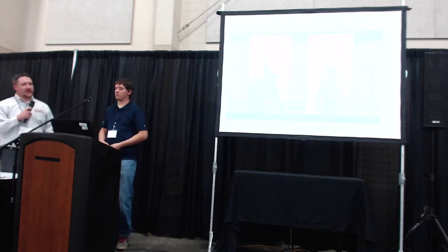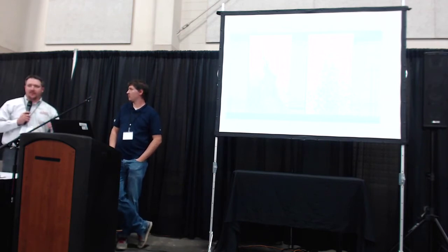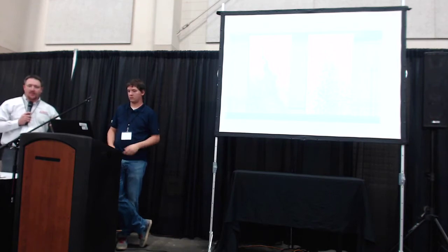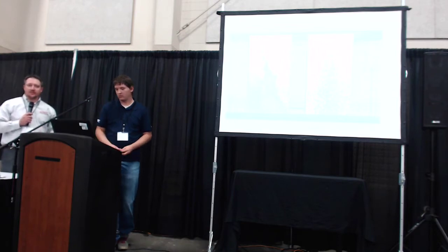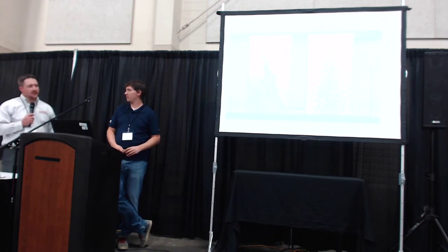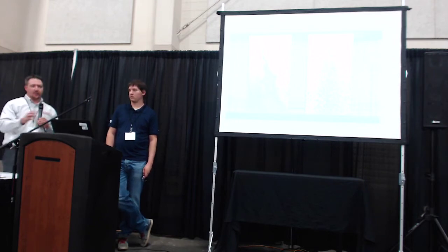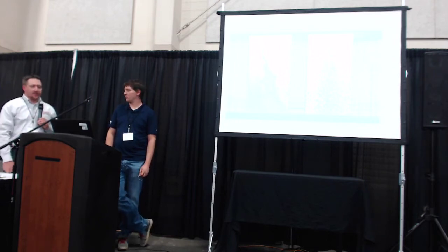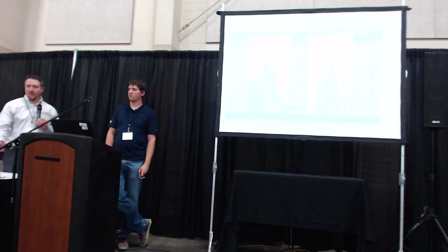Other points of segregation you're going to notice is you're going to have a guy behind the paver on that edge. He basically squares up the edge and then he rakes across the excess material. Sometimes they get a little too crazy on doing that, and you end up with just larger rock over the top. Also, where they pull a sample, you're going to notice a little rectangular spot there. So a lot of contractors are good about getting that patched in right away, and so their breakdown roller can get on that. But sometimes they'll just get stuff off of the wing of the paver where it's already segregated, and they'll just put that in the hole.